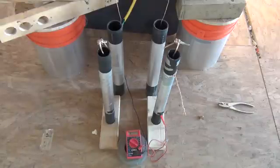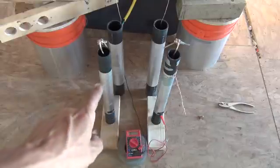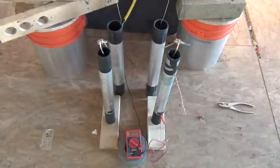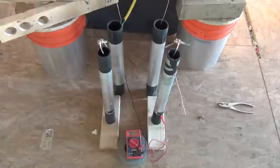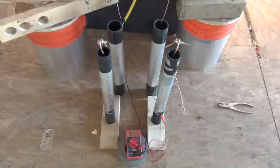I did see 13 amps quite a few times throughout, and at 33 volts that would be 429 watts. One thing to take into consideration is I'm only using one leg of my output — I've got an entire other leg right here that I can still tap into. So if this is correct, we're talking possibly 150 watts worth of electricity just on one leg of my output. Hopefully as we get a pulsing DC built and other things that are part of this, we'll be able to true that voltage and amperage up and tell exactly what kind of wattage we're really producing from this system. So far we've been able to produce both a steady amperage reading and a steady voltage reading from our step-down system — both are very encouraging numbers. Until next time, I hope you enjoyed this — this was Mr. Thessalonian and the Thessalonian Man Show.